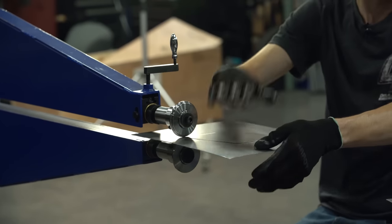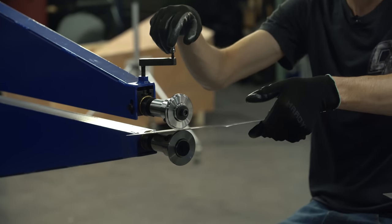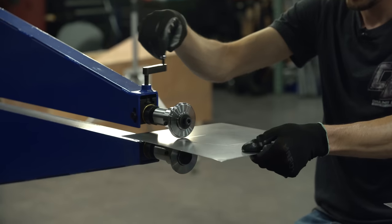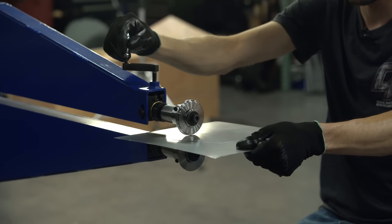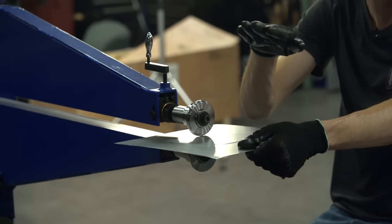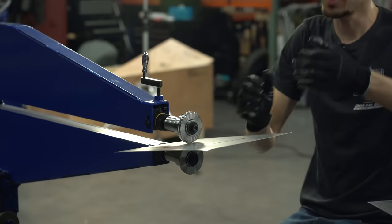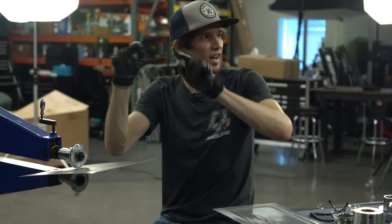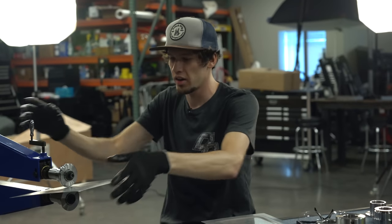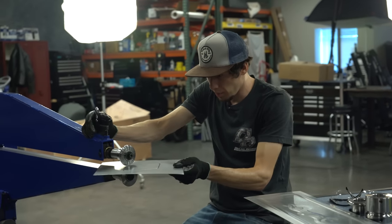Keep this flat — feel that resistance, keep it flat. If you let it do this it'll tip, so hold it. You feel it start moving and then just bring your pressure on as you're going slow, and that pressure fades in so you don't get that little kink. You take a panel and put it in the sunlight and you see all those little corner kinks — start and stop kinks around the border. You just do that and then go around your part.